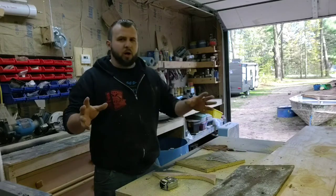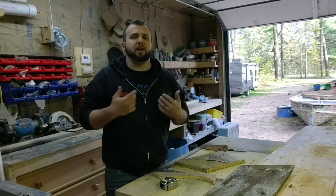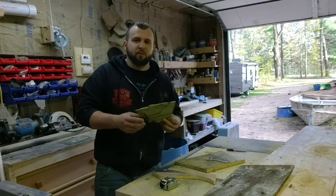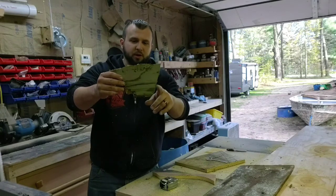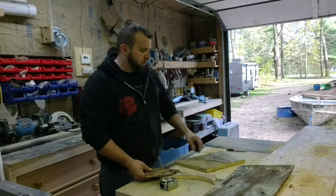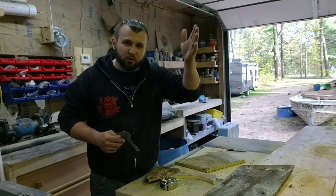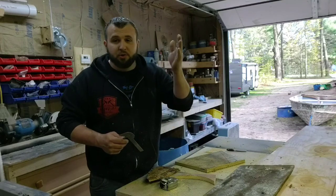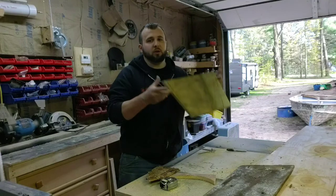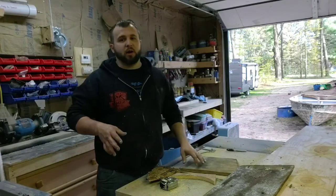And then it brings me back to the outside transom at the back that I had to replace. Because I want it to match up the same way it was before, when I tried to take that off, it just ripped into smithereens. But I was able to save one of the corner pieces, which gives me the exact old rounded edge. I used my angle finder on the boat and the old dirt line to get the actual angle for the new transom.